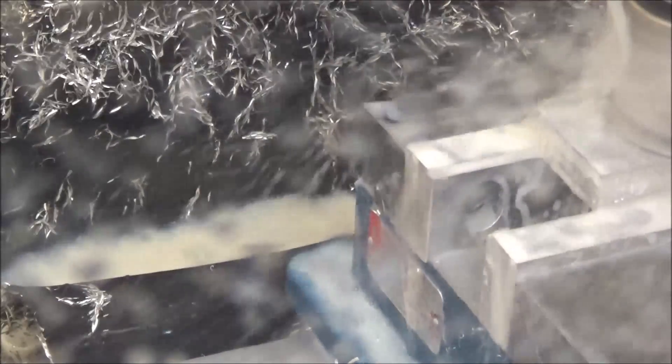Taking a sixteenth here with the 50 millimeter face mill at 10 inches per minute and 3000 RPM. We need to take about an eighth of an inch off the stock on each side — this is three-quarters of an inch total thickness.